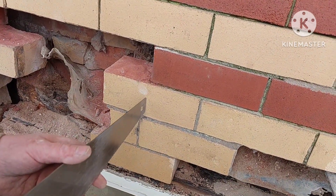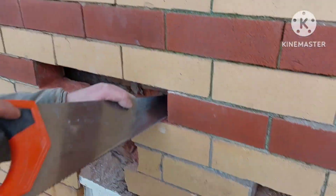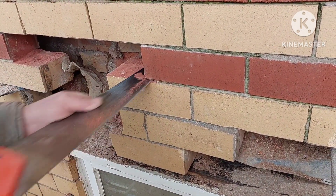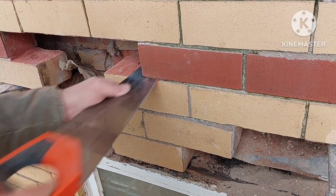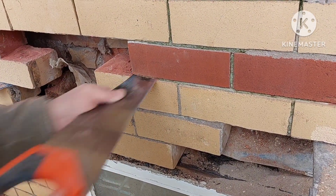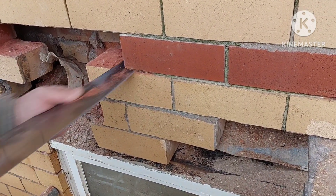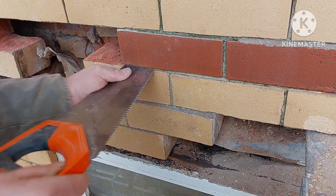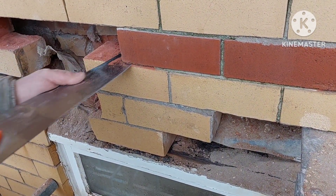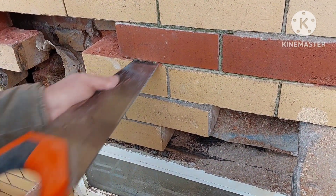This brick here is going to cause the saw to bind, for the simple reason - it's the pressures from that piece of steel pushing up. I was unsure at this stage whether it was pressure coming down or pushing up, but I found later it was actually the pressures of the metalwork pushing upwards, hence the big bulge in the wall. But I did manage to get it eventually and the job went well. We didn't lose any brickwork. We didn't get any cracking or movement anywhere. So the method of using an old wood saw worked, which of course I knew it would.